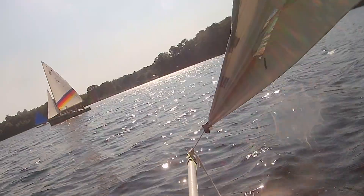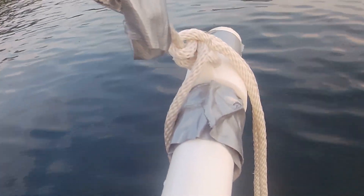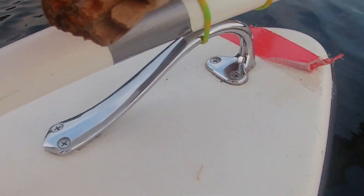There is more information on each of these difficulties in the guide document in the description. The two primary purposes of a jib sail are to increase sail power and therefore boat speed, and to utilize the slotting effect to improve the boat's ability to sail close to the wind. We were not able to apply any rigorous measurements to these two objectives, but we suspect the impact would have been significantly more notable given some changes. Here are some potential improvements: using a more appropriate sail material than a bedsheet, such as Tyvek or Dacron, or making the bowsprit longer and increasing the sail area.